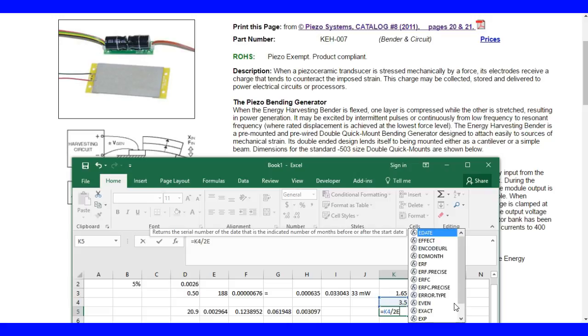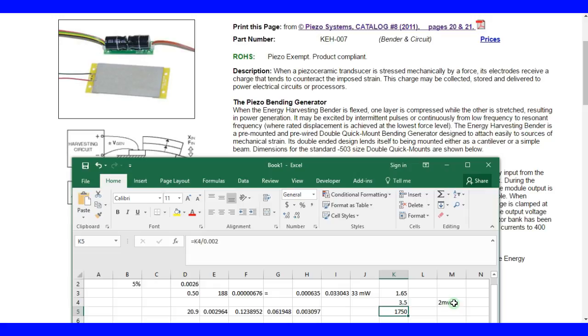Yeah, you're getting maybe 2,000 times faster charging from a wall charger than you are with this piezoelectric element charging at the optimal rate. So basically what this is telling you is that this is not for charging cell phones. Never ever for charging cell phones. This is strictly for, maybe, powering some sensor out on a bridge or something, where you didn't want to hook up power to it.